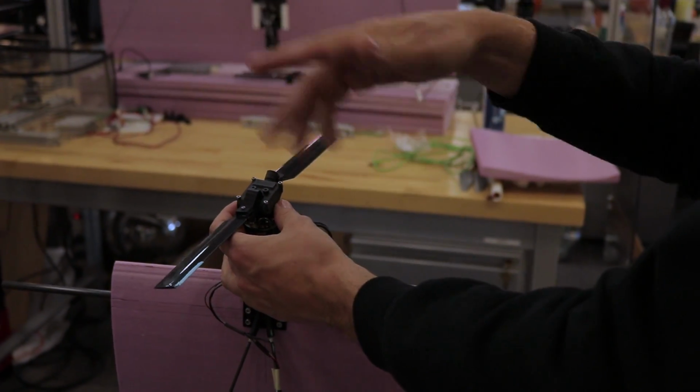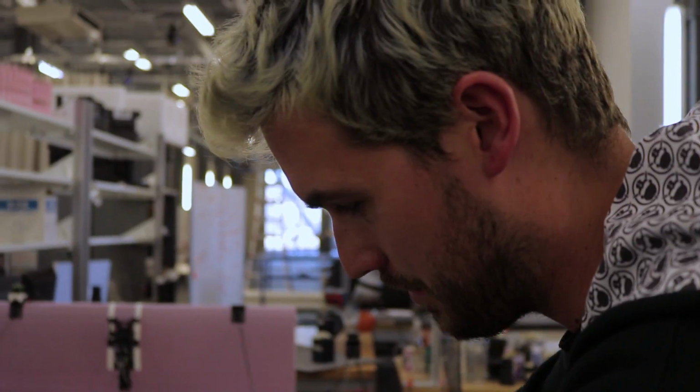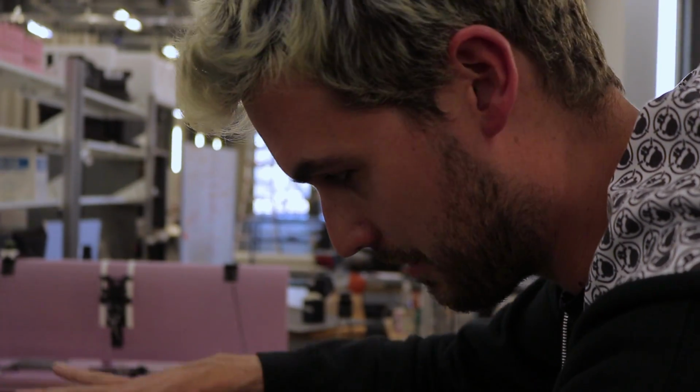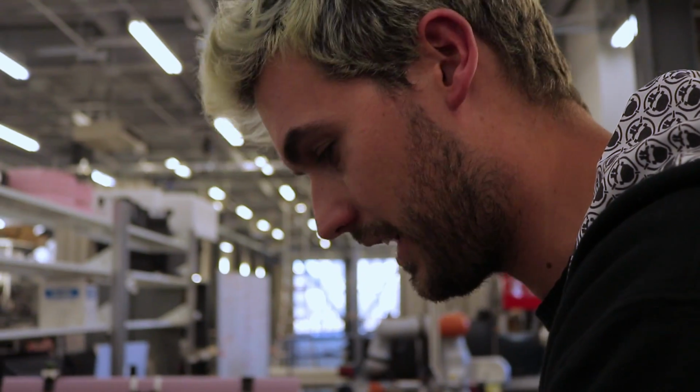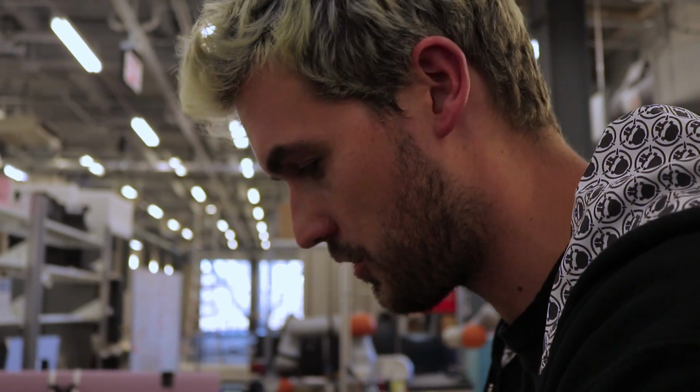So you've got a whole disk of motion, but if the pitch increases over here, you're going to get more thrust along the blade's ring of motion. And it's able to do that without any servo mechanisms or linkages, just based on changing the torque of the motor instantaneously when the blade is reaching the point at which it needs to change. Is that a good summary? Nailed it, yeah. Okay. So imagine a quad rotor that has 4 of those.